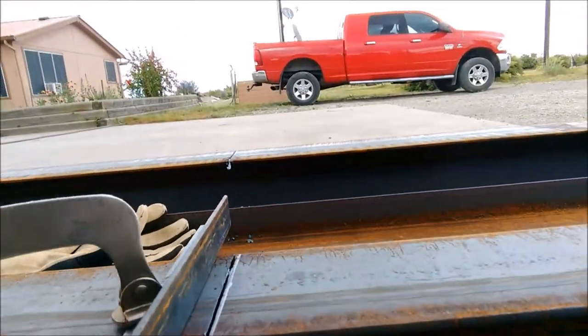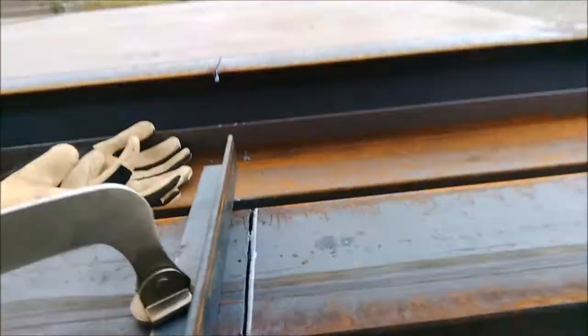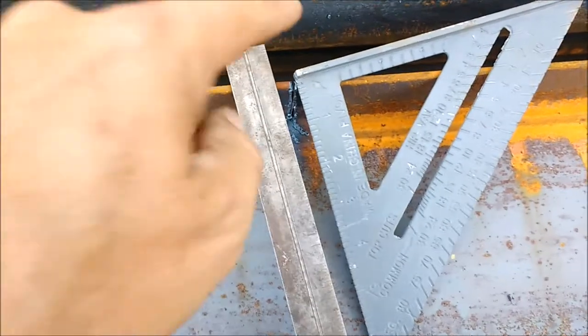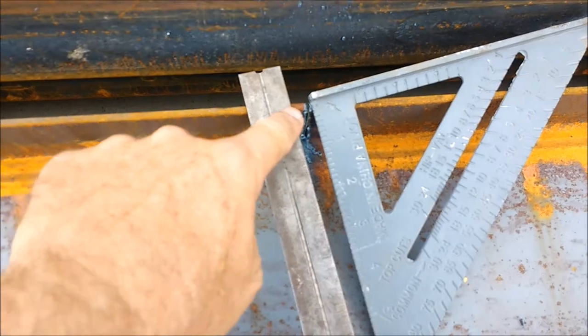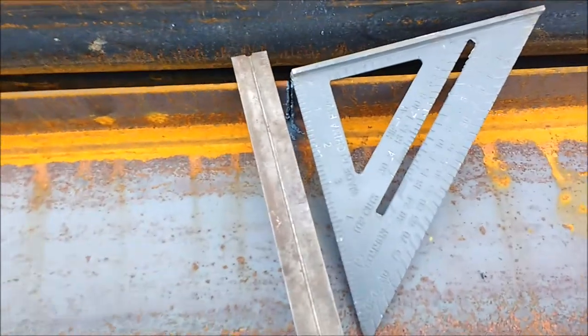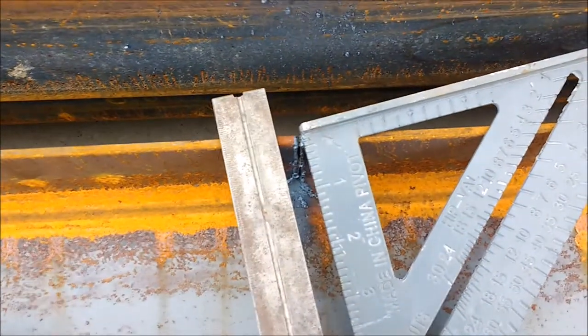Now 45 amps, which is plenty to cut it. 40 amps was enough to cut it. 20-foot beams. I've made this first cut at 6 feet. That leaves me 14 feet to put in the ground, 3 feet. I have 3 feet in the ground. That'll leave me 11 feet above, which would be enough for the tractor to go under.